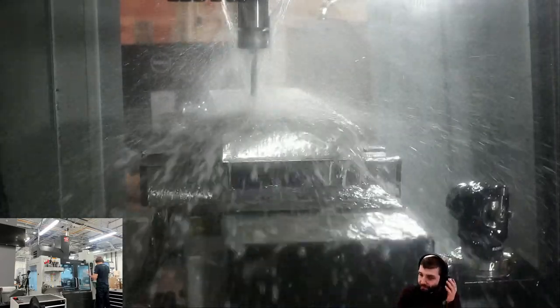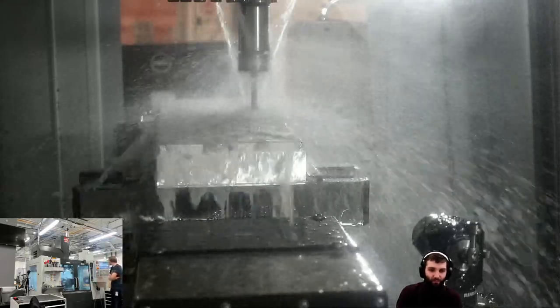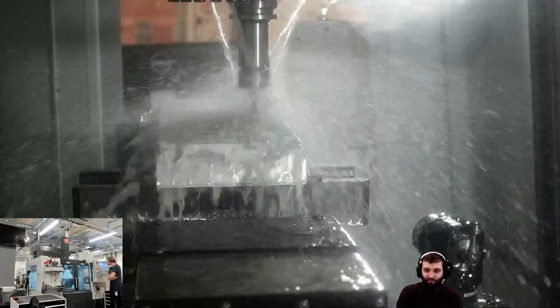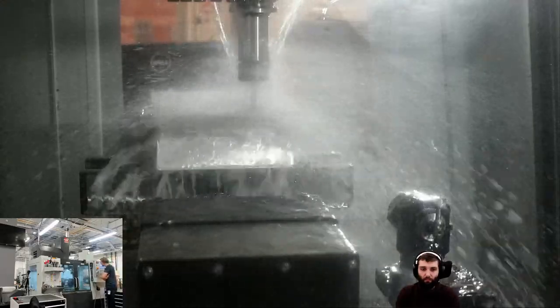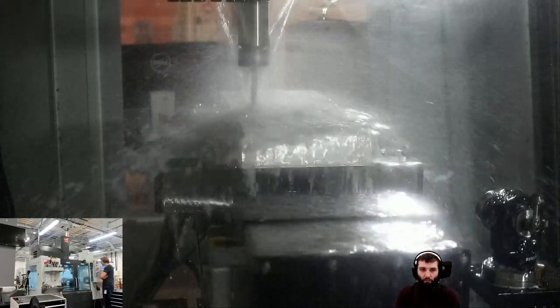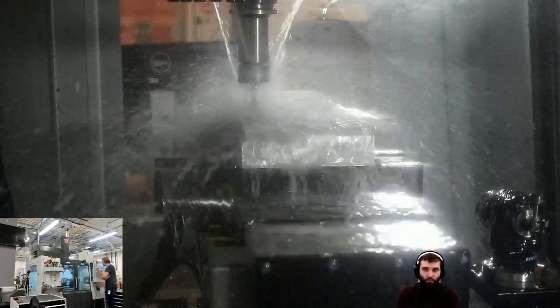So we've got our drilling up, everyone, now. I do like watching a bit of drilling. It's satisfyingly quick, normally, drilling is. The trick with drilling is to get your chip breaking right. There's still a 16 millimeter end mill in here that eludes me. I'm struggling to get that to chip break right, but I'm not a material expert, and I'm nowhere near good enough to get it chip breaking properly. I've got all the others going well, though. Right, here we go. Those four holes drilling in nicely.